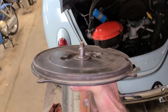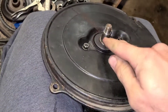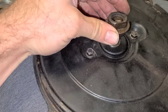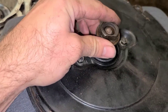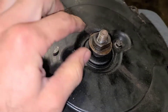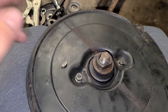Going back on: I've got the plate secured to the generator with the two 10 millimeters and lock washers. Make sure not to lose your key in the rear. We're going to slide the fan bushing on to hold things in place, then put on the same number of shims that you had. Make sure your key is in place. We're going to pull the fan out and test-fit it to get the right number of shims so we're not rubbing on the plate.